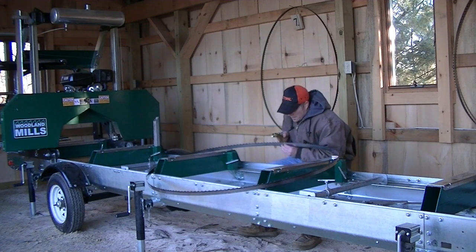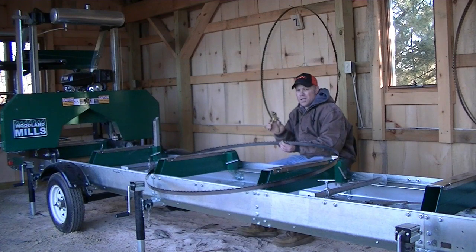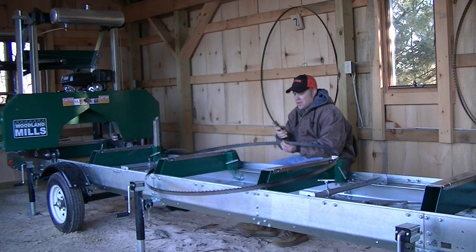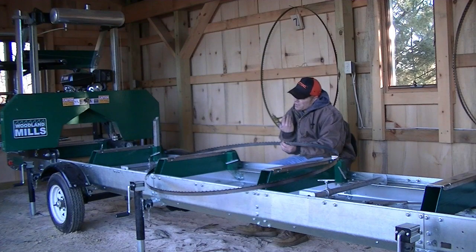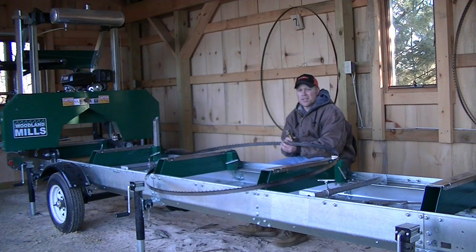All you do is line this up, put the little bending arm to the top of the tooth, and squeeze it down till it stops. Now I use these ones on setting 6. It looks like it goes setting 4 through 12. But like I said, I use setting 6.